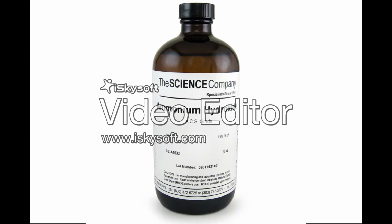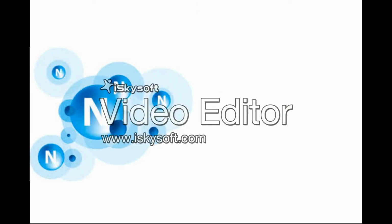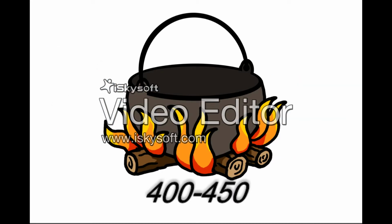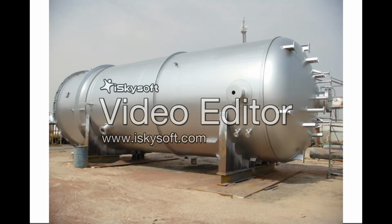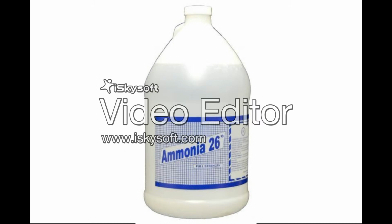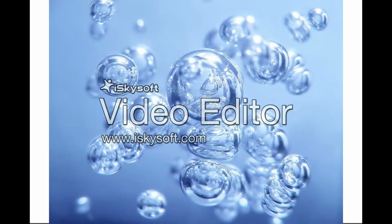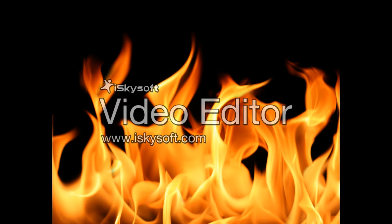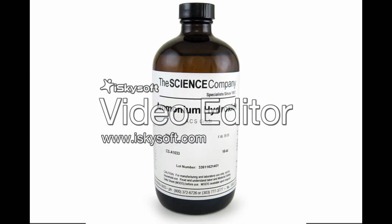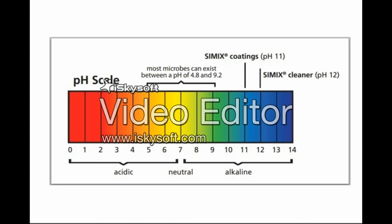So the next chemical is ammonium hydroxide. Ammonium hydroxide is created through a method known as the Haber process, in which nitrogen from the air is mixed with hydrogen from natural gas in a 1:3 ratio and is then heated to between 400 and 450 degrees Celsius around an iron catalyst at a pressure of 200 Earth atmospheres. Then rapidly cooled, causing it to condense and giving you liquid ammonia. The liquid ammonia is then heated, turning it into a vapor, and bubbled through water. Ammonium hydroxide is an alkali solution, meaning that it has a high pH level.